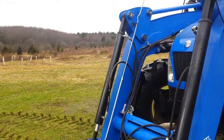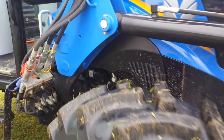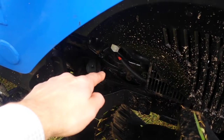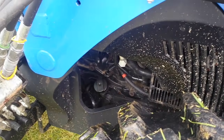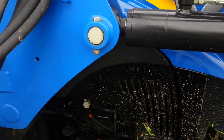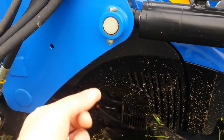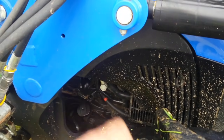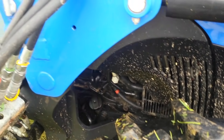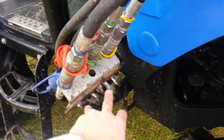One thing that happened was I was getting some crankcase pressure, which was exhibiting itself with oil actually spitting out towards the dipstick fill tube. It turns out that when New Holland paints the engine, there's a small plug on the other side — it must be a crankcase breather — and there's a little plastic plug in there that just needs to be pulled out. It had black paint on one side and was clean on the other, and pulling it out resolved the issue.